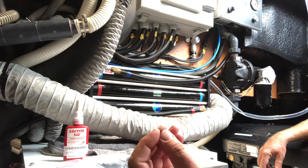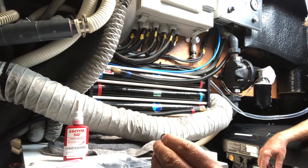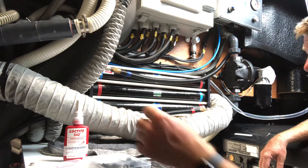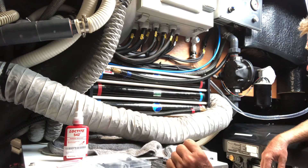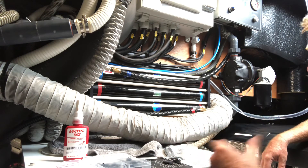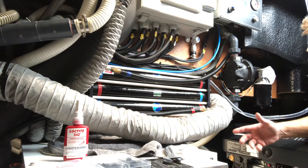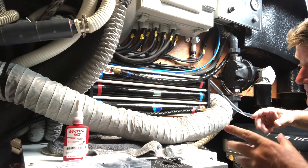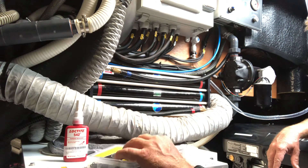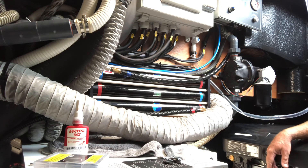Those are these right here — they work great. They're a little thin and don't completely fill the groove, but the clearance seems correct. I was trying other o-rings and you'd push it together, feel it was too tight, then pull it apart and tear the o-ring. These went in with a lot of oil — they felt snug and I had a feeling they'd work just fine, and they did. So far so good. Have fun working on your watermaker!